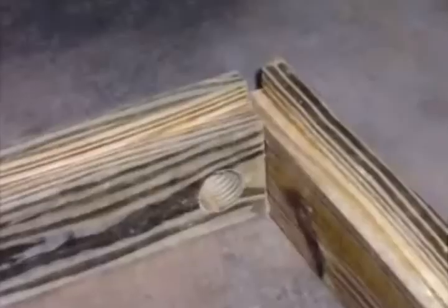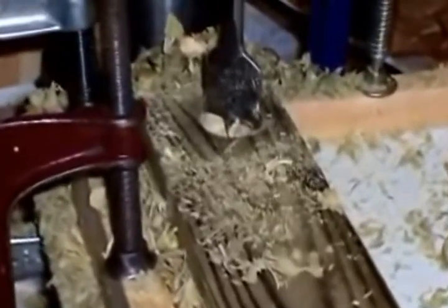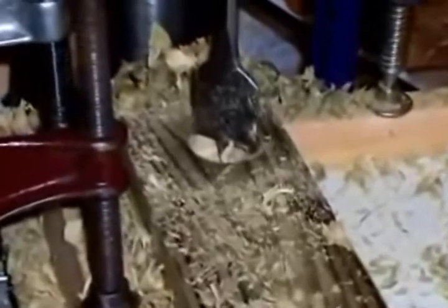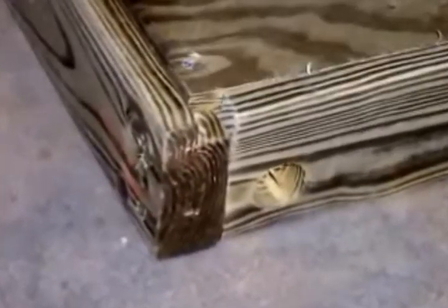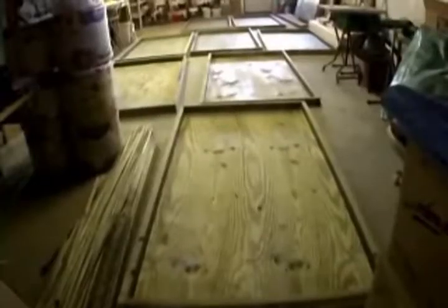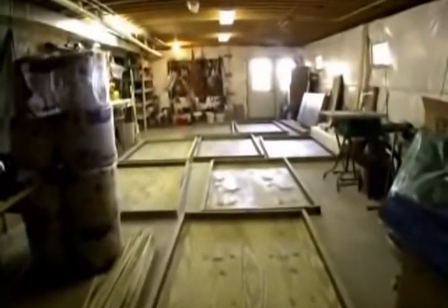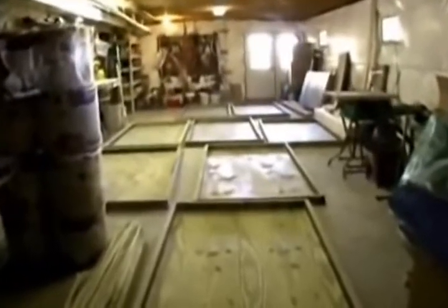I let the panels hang in the basement for about a month to let them off-gas before putting them into the boxes. For building the boxes, I cut a rabbet in the back of each pressure-treated 2x4, then drilled holes where the headers will exit the sides of the panels. I assembled the boxes with screws, including the plywood back, which fits into a rabbet in the back of the 2x4s. Each box also has three 2x2s running across the back of the panel, which supports the copper core solar panel and strengthens the plywood back.